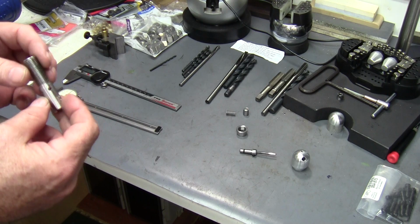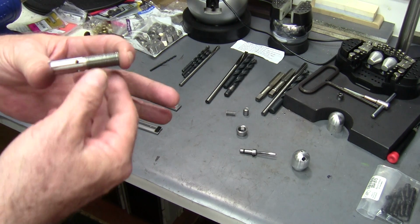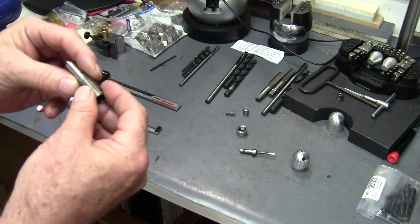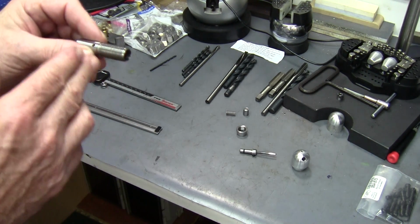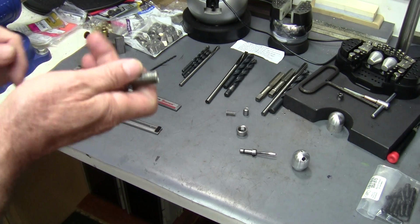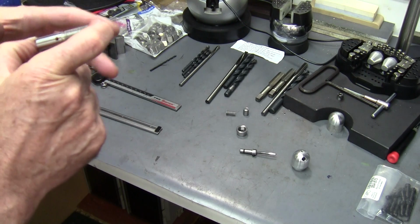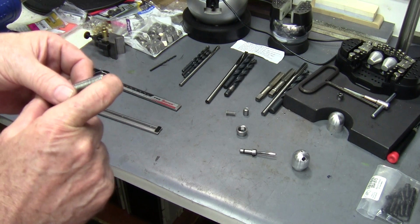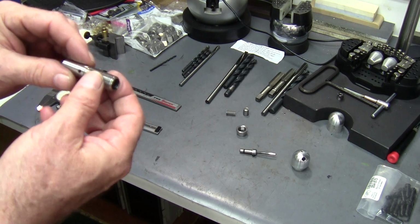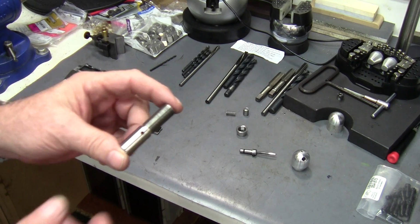in town. So usually the first thing I do is I cut the threads. That way, if I mess the threads up and something goes wrong, I can just cut it off, pull the bar out, and keep on going. If I cut them all to 2 1/16, whatever the length I decide, and then I mess a thread up or mess something up, I lose the whole length. So, just the way I do things.